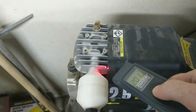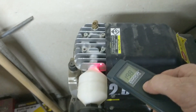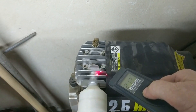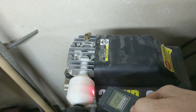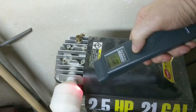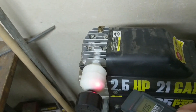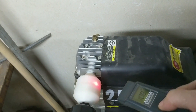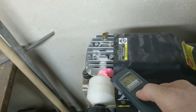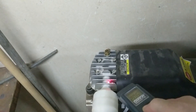We're back — it has just finished charging. There are the gauges all the way up at 125 PSI. It took about 8 to 10 minutes to completely charge up. Temperature reading right at the aluminum head where the muffler screws in is around 198 degrees Fahrenheit; going further it goes all the way up to 230 Fahrenheit. The part itself is reading about 107 to 113 degrees. It didn't heat up as much as I thought — the air rushing through it probably kept it pretty cool. PLA might survive the temperature, PETG would, but the vibration would kill the PLA.